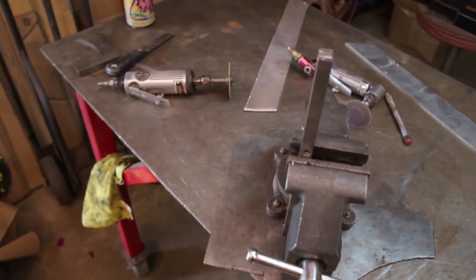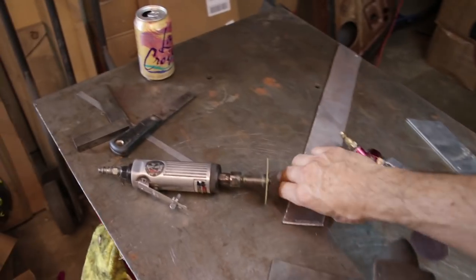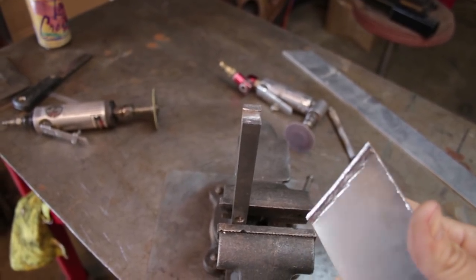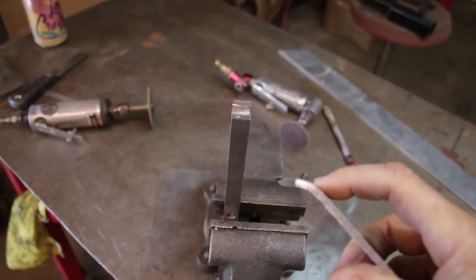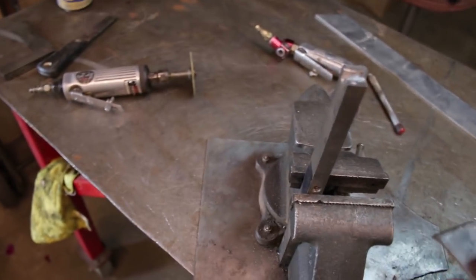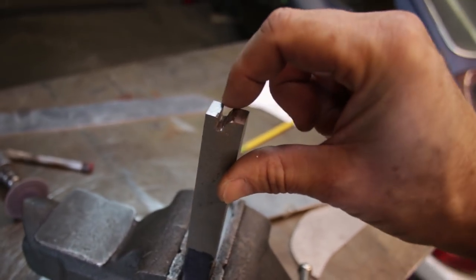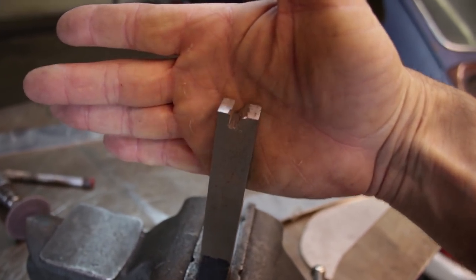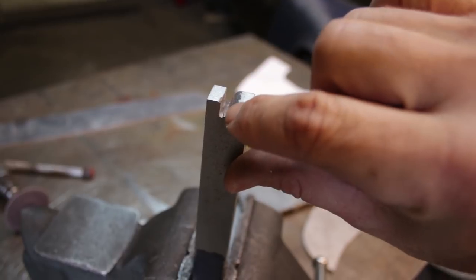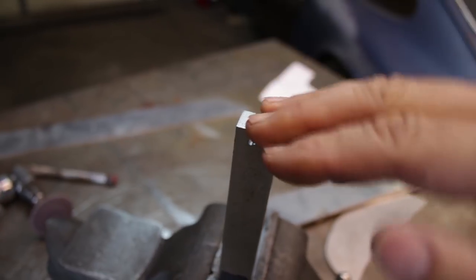Here's the custom tool I made sticking up here in my vise to make that little bend. I've tried it out on the end of this piece and it gets me a pretty close bend. I don't need to bend all 90 degrees - I need to bend about 45 degrees and I'm looking for approximately half inch radius. The way I've done this is I've created this notch in this piece of steel. You can see if I hold my hand behind there, I just cut in to the right depth that I want the bend to start at. And then I radiused one side of this piece of steel so that as I push the piece in and bend it over, it gets a radius.